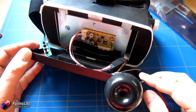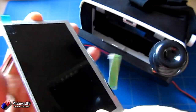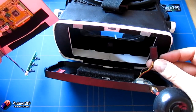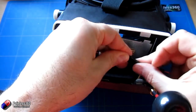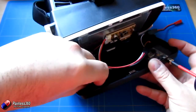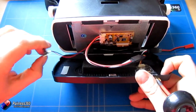We'll come back in a sec when I've got it almost all together, do the final assembly, and then I'll show you what it's like to use. So the epoxy resin has just about set. We've actually put those two lugs onto the top — we know it's the top because I mounted it with a T. It's covered with protective film which we'll take off when we put these things together for the very last time. Now we're going to test fit everything and make sure it's all working. We'll plug the screen into this cable, make sure the polarity is the right way — black to black, red to red. Then we pop the screen in position, peel off the top of this sticky plastic, and mount those buttons.